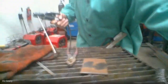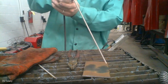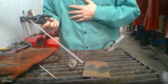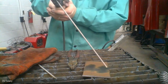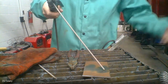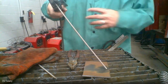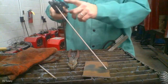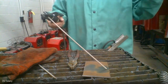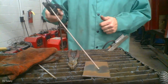One more item they didn't cover in the videos: when you go to start your weld, it will happen to every one of you at some point — I've been welding for 35 years and it still happens to me. When you bring your rod down or start welding, your rod might stick to the metal. We call it sticking the rod. When you stick the rod onto the metal, you will hear your welder bog down because you have a direct short and you're pumping full amperage through the rod to the metal. We need to get that rod off the metal. Do not shut off the welder when the rod is stuck on the metal.